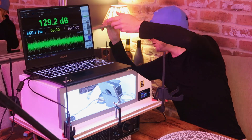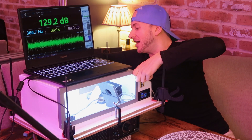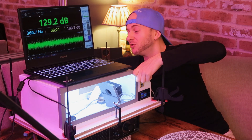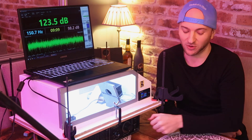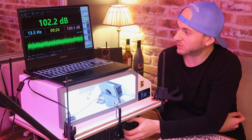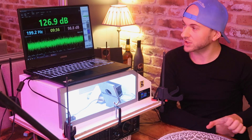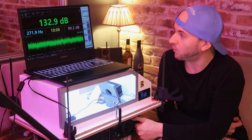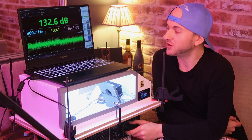Now let's seal off the cabin and completely close the door off to nullify the Helmholtz mode of this cabin and run those tests again. I imagine we're going to see similar results at the higher frequencies but a significant drop-off on that 25 scaled hertz where it's unloaded. Door closed results: 25 scaled Hz — 15.2 watts and 123.5 dB. 33 scaled Hz — 15.02 watts and 126.9 dB. 45 scaled Hz — 15.2 watts and 132.9 dB. 60 scaled Hz — 15.7 watts and 132.6 dB.